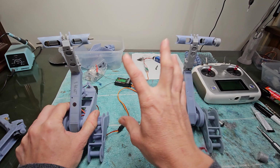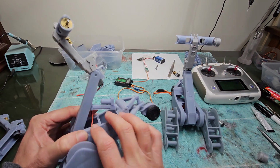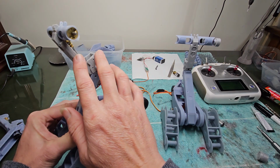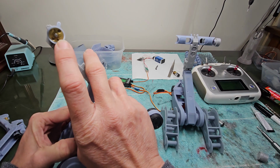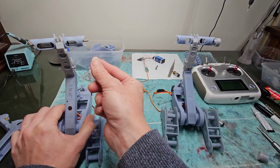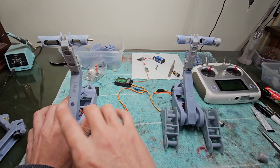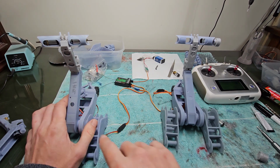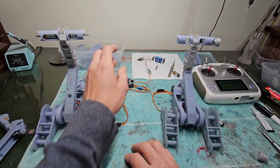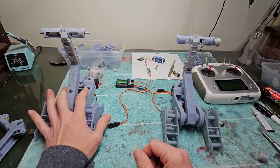So to be able to see just a static one turned into this is pretty mind-boggling to get your head around. If you've ever seen one of mine, they're not that big. So the motors just slip in here, and that'll give you the manual movement for the arms. There will also be another motor here for that one. So I'm only doing 6 points of motorized articulation because it sort of suits most things like your RC receivers, and a couple of the little microprocessors are usually 6 channels, so I'll just keep it at 6.